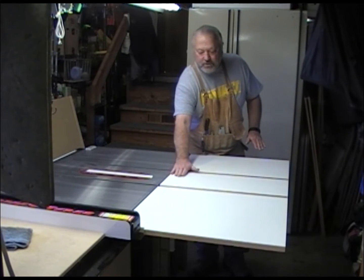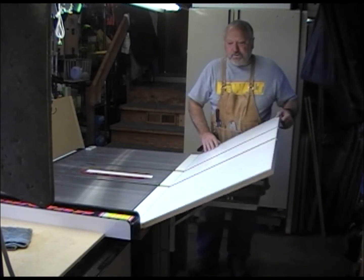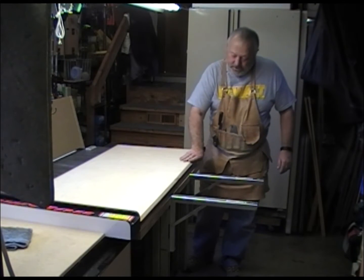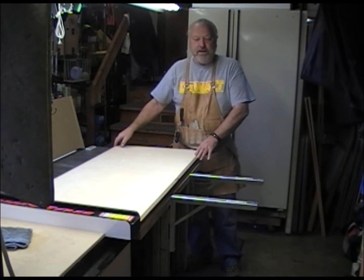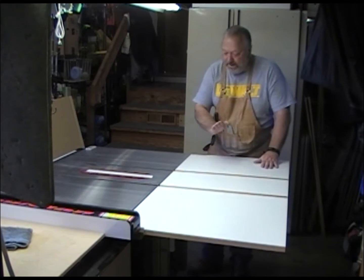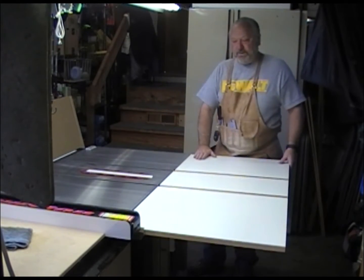The nice part too is even if this loosens up in here, the angle is that way, and I don't know if you can see it, but you actually have to have 2 angles. Otherwise, it won't roll around. It'll catch. So I just cut a 45, and then I flipped it over and cut it again, and the hinges are just made out of a couple pieces of maple. But the cut is back that way, so even if it loosens up a little bit, you're still going to be able to get right over the top of it, and it's just below this part.